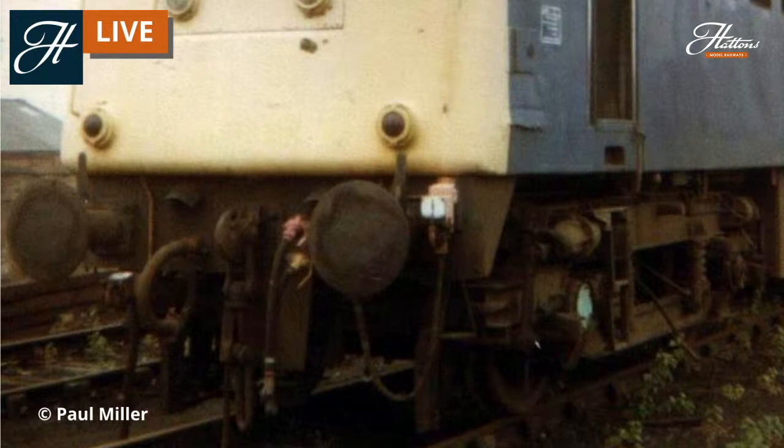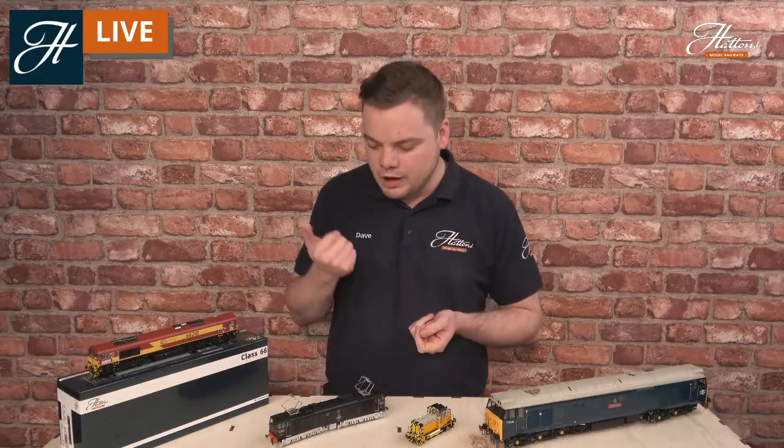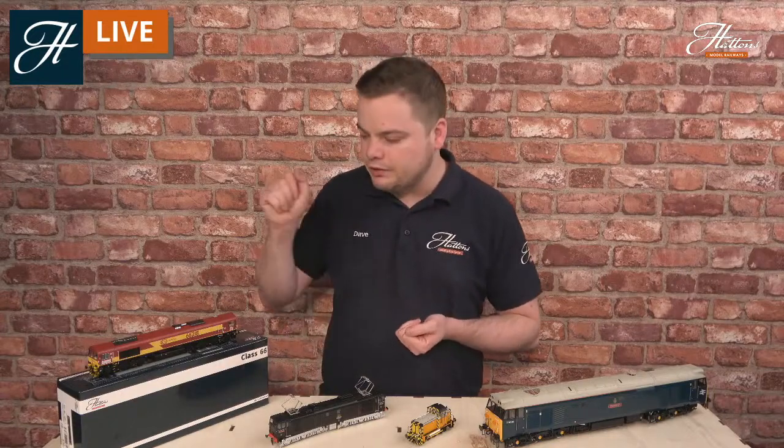We did promise some electrics. Here's one of the early Class 81 locomotives: very similar kit to what we've seen previously — vacuum brake to the left of the coupling, the coupling hook and screw link coupling, air brake pipes, and to the right of the right-hand buffer, the electric train heating supply. There's a lot of similar equipment shared between locomotives of past and present — from the EM2 Woodhead electric of the early 1950s right through to the Class 66s and Class 70. It really depends on the purpose and construction date of the locomotive as to which parts are fitted, with obsolete vacuum brake and steam heat systems not featuring on something like the Class 66.